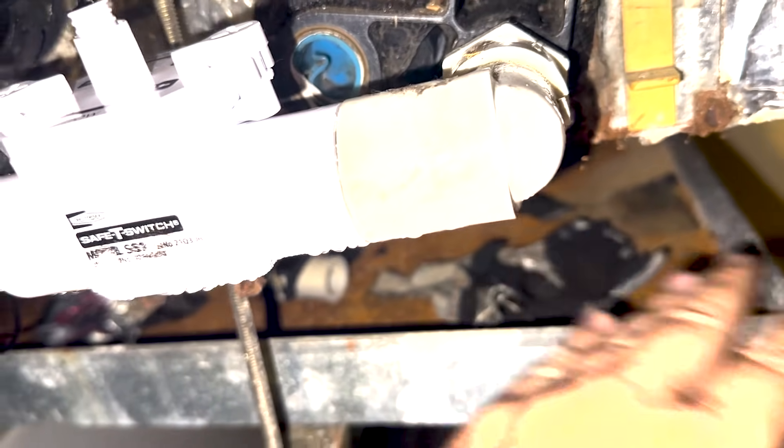You come out here — we have our safety switch, or you might have one in the pan that has water in it. If your pan is filled with water and the safety switch is keeping it off, that's why the unit is off. You would drain the pan, suck it out. This particular safety switch shows you how to loosen it — you take the top off, and if the water was overflowing or at the top, that's what's shutting off that switch. You would suck out this line, and then turn it back on.